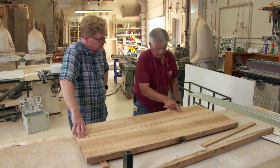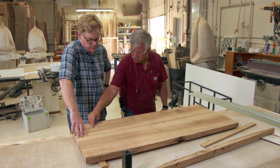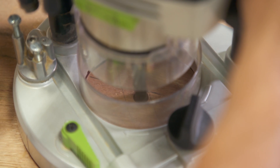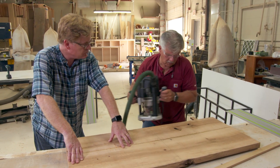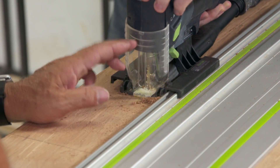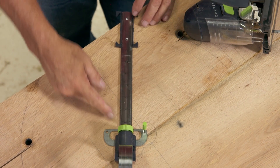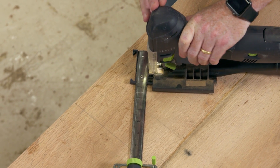So now we're going to cut the straight line that goes here where it meets this arch. You're going to do this line right here, and then we're going to stop it here and run another straight line. What I want to do is drill a hole right here to act as a relief to soften that inside corner so it's not a real sharp corner. To do that, we're going to drill the hole with a plunge-cutting router and use a spiral up-cutting bit to pull this stuff out. So we've made our two straight cuts, and now we're going to cut this radius cut right here. To do that, we're going to use this adjustable compass. All we're going to do is take the saw, lock it in, turn the saw on, and just slowly cut your way around it, and that should make the radius that you need.